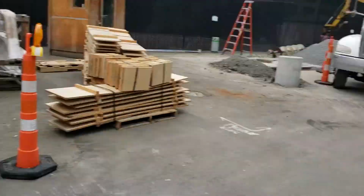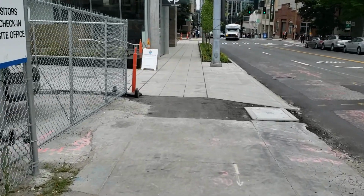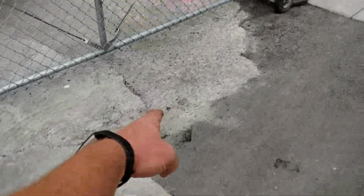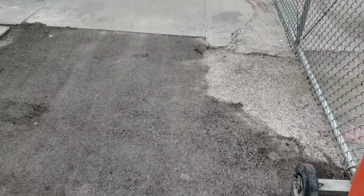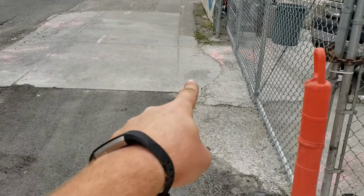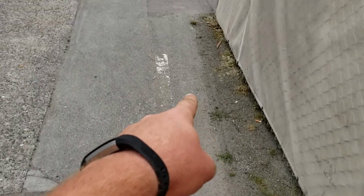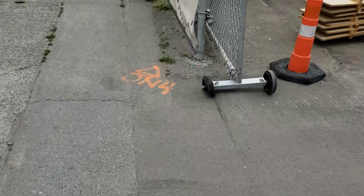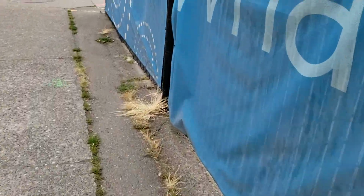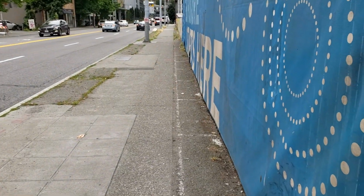So now I'm on the north end of the lot, looking back on the scope, and there's this sidewalk. That's the sidewalk to the alley, right? It seems like it'd be this saw cut line here, but I'm not positive. I mean, that's what it looks like, right? It's this line. So we'll need to bust out this panel here, or grind, but we can't grind through that. So bust out this panel, excavator, grind this asphalt to the corner, and all the way down. So there it is, Mark.